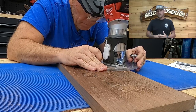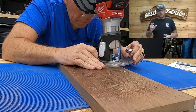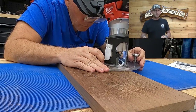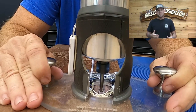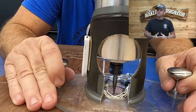Now, Dad did all the carving on this, and he did it with the carving liner. It's a really fine tip bit, and it works great for small lines like that. I'll put a link in the description below. These tiny little letters and tiny little lines took a lot of patience. You can't try to go too fast, otherwise you're bound to mess it up.